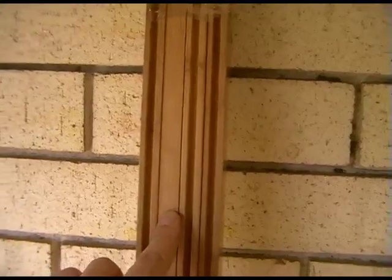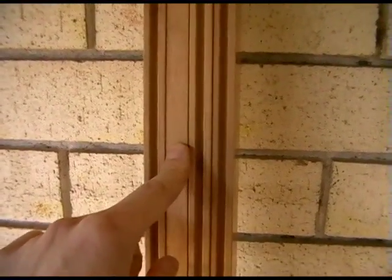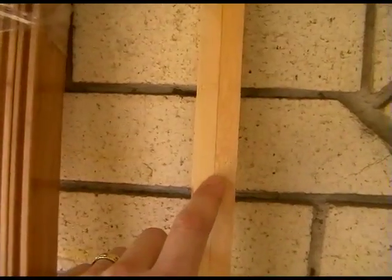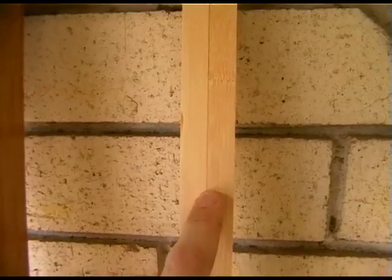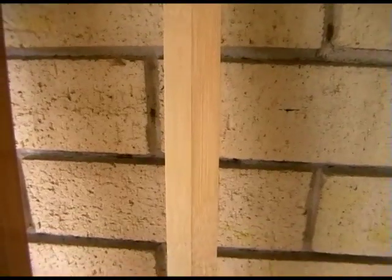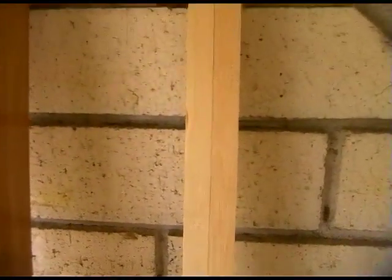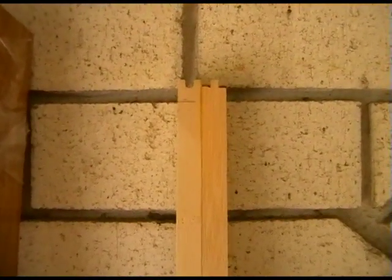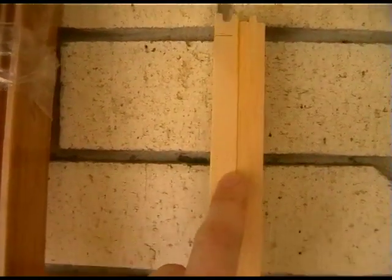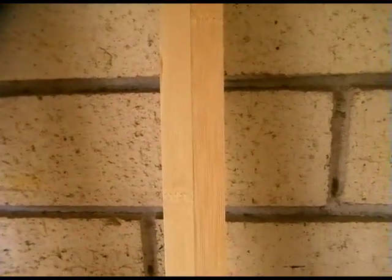The boards are too thin on their own. I make my children's size bows out of one layer and then shave it down. But to make an adult size bow — if you look down the middle there you can see the glue line — I've actually planed flat and glued two strips together. In order to get the required thickness, there's the tongue and the groove, I've had to glue two of them together.